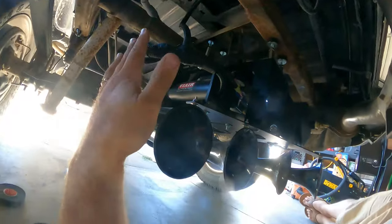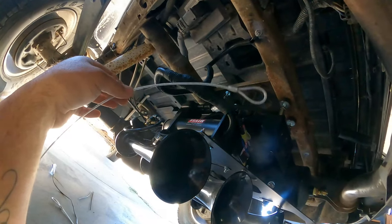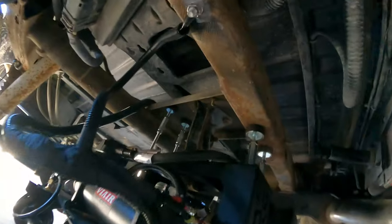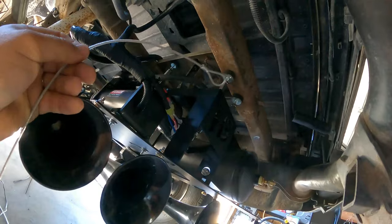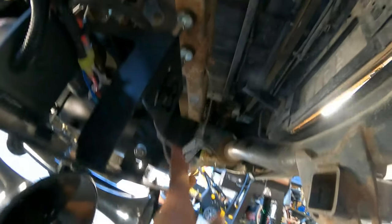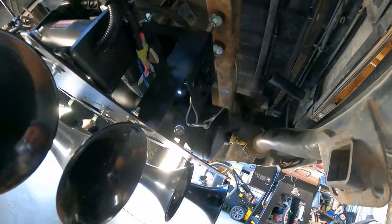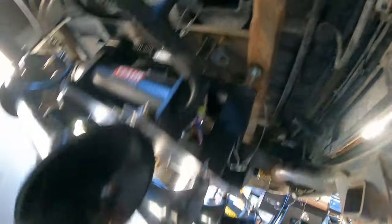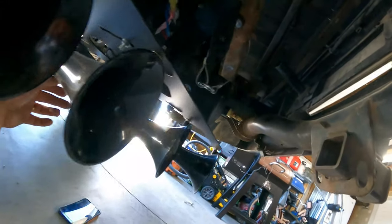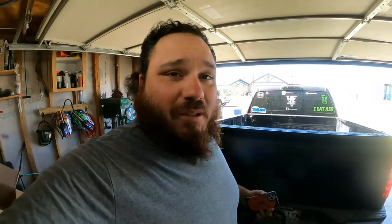All right, got everything up - I apologize if the sun is making this crazy, I scratched my lens and I'm not happy. We gotta put these safety loops back on - what that does is, if that cable breaks, these will catch it. So these safety loops just go up around the frame, you got two of them. Put that one back there and that one right there - pretty much like if you're towing a trailer, if that cable breaks you don't want this thing to go through someone's windshield.